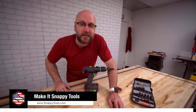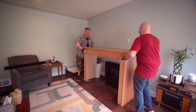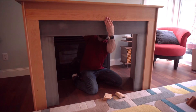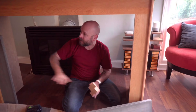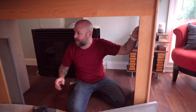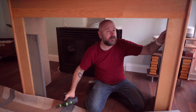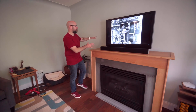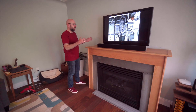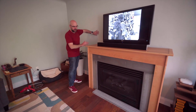Let's get back to this fireplace and get it installed in my living room. Just clamping these in from behind — the concrete is slid in there and clamped down with little clips screwed in the back. That's how the old one was built, and actually how the marble slabs fell out and broke. It's not anchored to the wall in any way — the old one wasn't either. I need to get a multi-tool and cut the trim so I can get it flush against the wall.